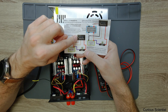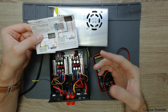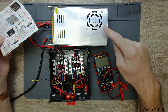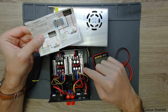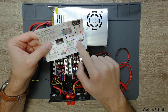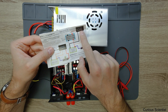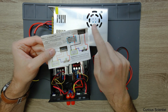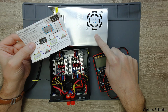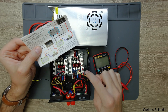In this left-side case, you cannot go below 5 volts at the output because otherwise the screen will not turn on — this power meter needs at least 5 volts to power the screen. On the other hand, the design on the right side is different. This drawing expects you to use a main power supply and then a separate DC-DC converter just to power the power meter. What I did here, as you can see in the drawing, is use this main power supply to power the power meter and connect everything accordingly.